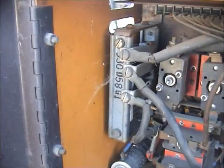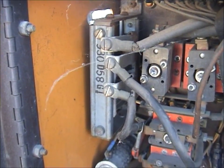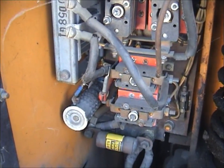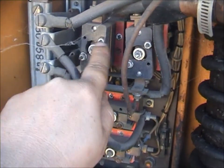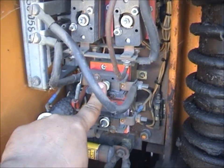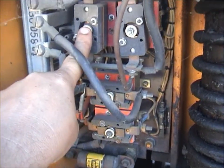Something to note about this old unit is it still uses a resistor pack for speed control. It doesn't actually have a DC speed controller — it's all done through logic with the contactors. That's forwards, reverse, and high speed. Yeah, that's high speed and just that one by itself is low.